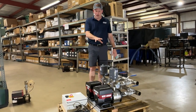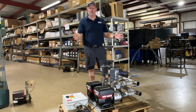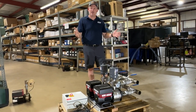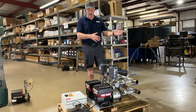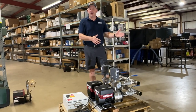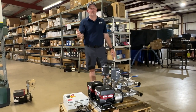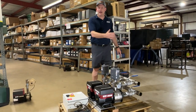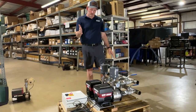This pump system is well suited for around 65 to 70 gallons per minute at around 50 PSI, or at lower flows 30 gallons per minute at around 70 PSI, with a maximum of about 140 GPM at around 26 PSI — so it can handle a wide range of flow rates while maintaining constant pressure.